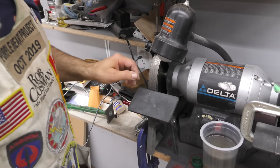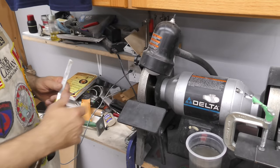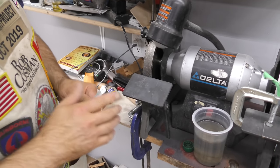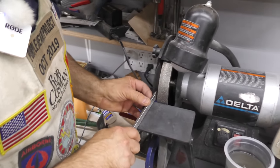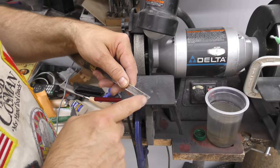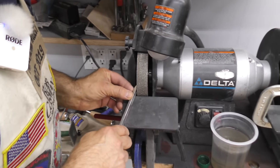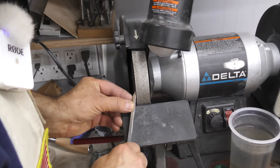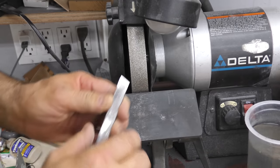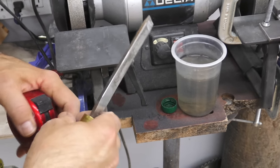On the bench grinder, I'm using a CBN wheel that has abrasive on three sides. If I use the face it's going to be hollow ground — I don't want that. I like it laying nice and flat on the wood. You have to do this by eye because of the way it approaches. You don't want the end of your chisel squared off — it's skewed on an angle. Set it on the tool rest, feel your way in until you make contact with the side, then go in and off, in and off to keep it from overheating. I switched to a half-inch skew chisel — also a Henry Taylor — so I don't ruin the one I just sharpened.